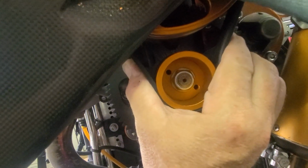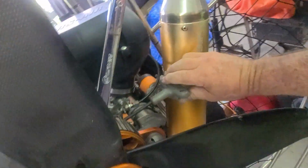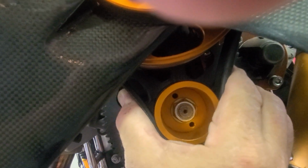So you can see how far I'm squeezing it now. What we're going to do is loosen it back up again. Plus this is hard to do one-handed. Put the wrench on, snug up a little bit. Got that eighth inch play there again. Tighten it back down. Okay. Get that out. Complete revolution, which is like 2 turns. Then we're going to test it again. Yeah, that's good there.